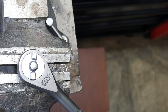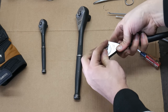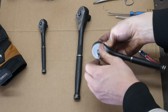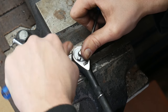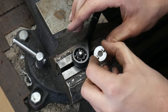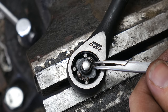It was at about this time I figured, let's just take them all apart — both out of curiosity on how the mechanisms might differ, and because I was hoping to find a reason why the smaller ratchets have detents that hold while the half-inch doesn't. We'll start with the quarter-inch ratchet. This one comes apart in the exact same way, although the parts are smaller so it's a little bit more fiddly. And once we wiggle out the switch, we can see that the mechanism is basically the same, although it uses four rollers instead of eight. But the detents and the cage are set up the same way.